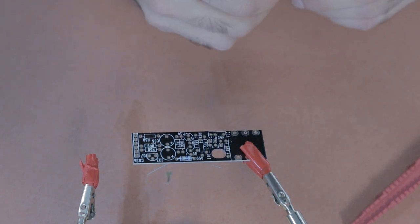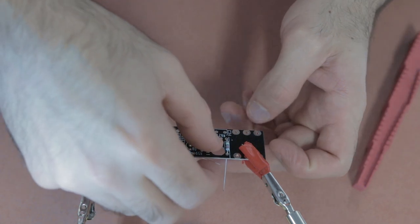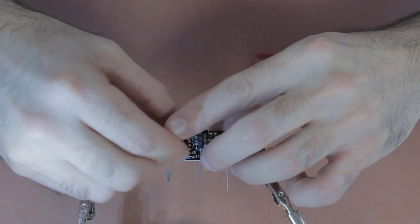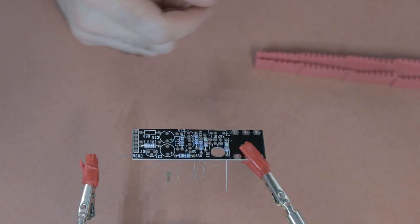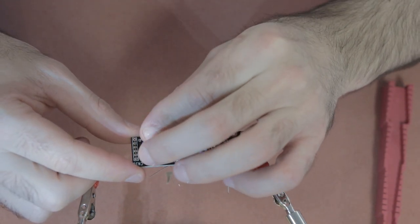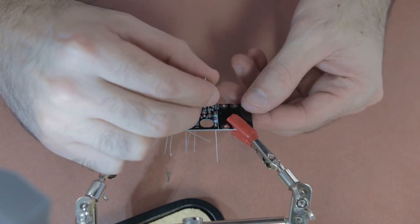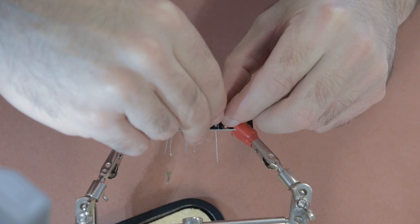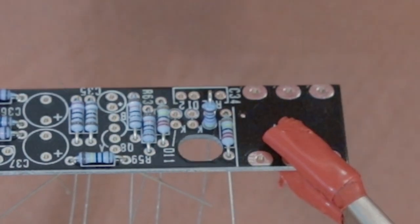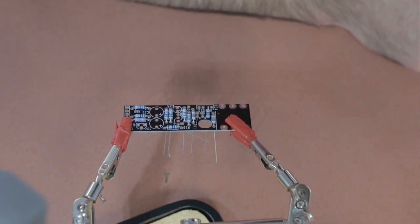You can use the forming tool from video one — it makes it easier to get the right measurements for the legs so they slide nicely into the PCB. Use your PDF to find the locations for each resistor. There aren't too many components in this DI build, so it shouldn't take too long. Start with the horizontal resistors, then move to the vertical ones. With vertical resistors, make sure the longer leg — the bottom of the resistor — touches the part of the board with the little circle.